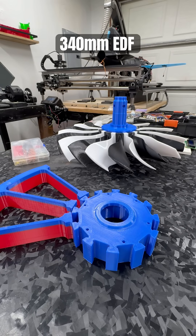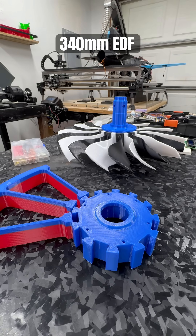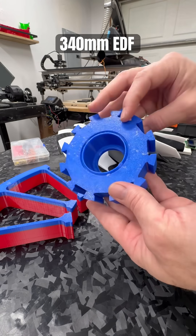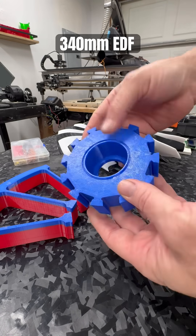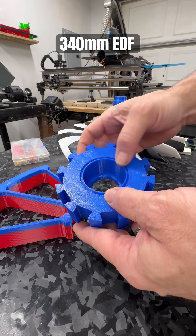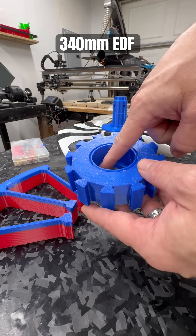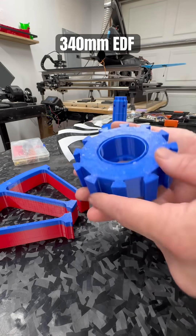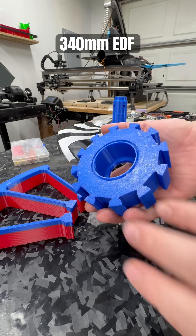Fan build update. What I wanted to show you was the hub and how it's made for the four bearings. I'm making a cap that goes over and locks them into place. There are four sets of 40mm bore, 52mm outer diameter, seven millimeter thick bearings.